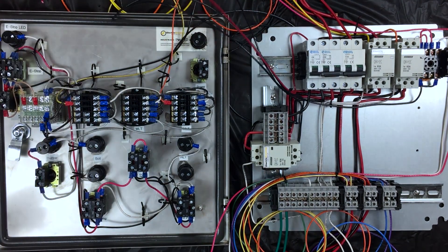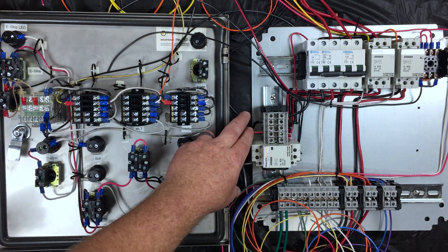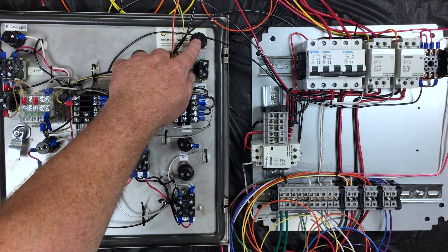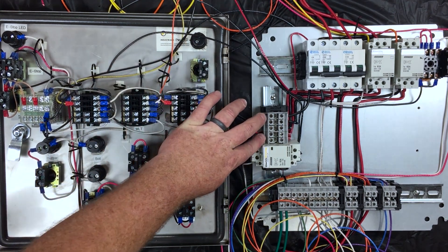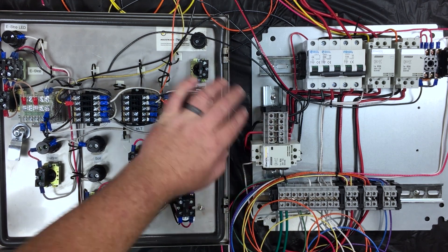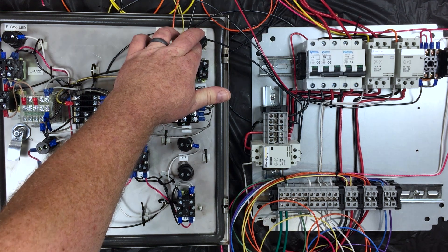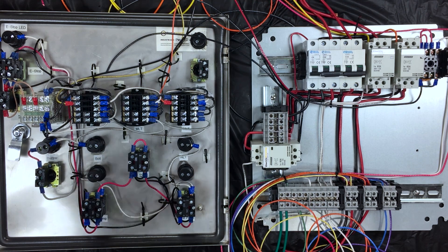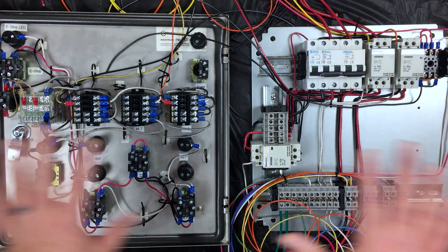The red wire here will come in and give power. There'll also be two red wires that come off of these contactor blocks and go to the power LED — this is a 220-volt light, so it will run one off of each side of the contactor block and make a connection to this light, so that whenever the system is powered on you'll know you have power to both sides of the terminal block and everything is operating properly. That's a real high-level overview; we'll go over it in more detail whenever we get both pieces together, which will be the next video.